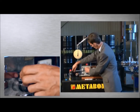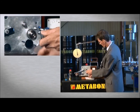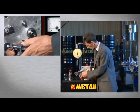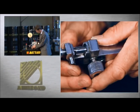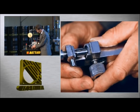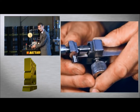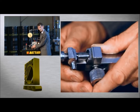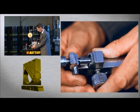Now let's see the abrasion mark that results from the metal surface finish under multiple overloading. A very smooth, bright, small dot can be seen. The very smooth and very hard surface offers ideal conditions for the lubricant, so it's able to separate the parts moving on top of each other and to use its lubricating properties.